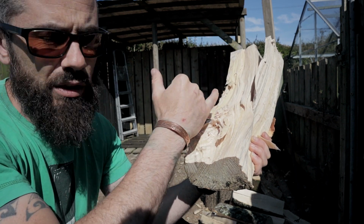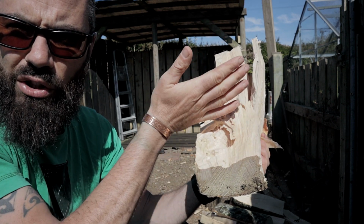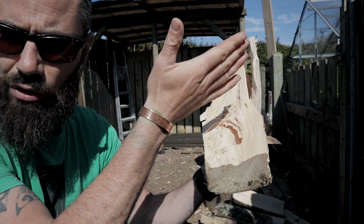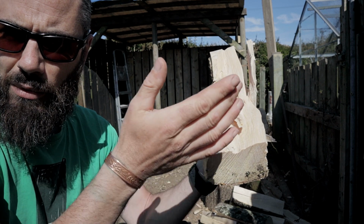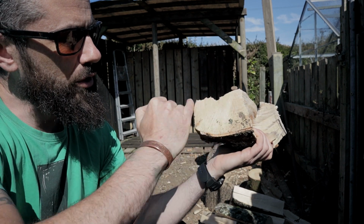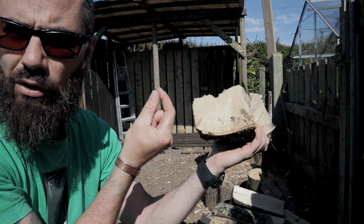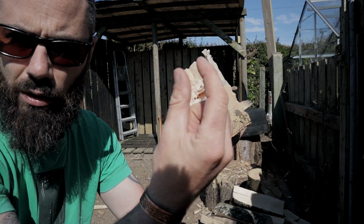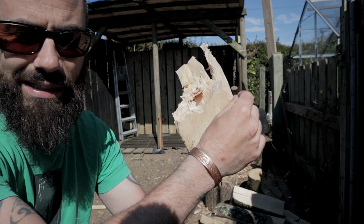As soon as you get into different grain, where the wood has changed grain, like a branch piece or something like that, the noodles change. So sometimes you'll see dust come out. Sometimes you're nearly cutting straight down into the grain, so the dust is of different size compared to cross cutting, where you're breaking the cells in a different way.